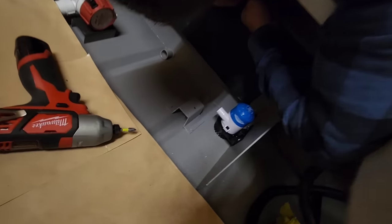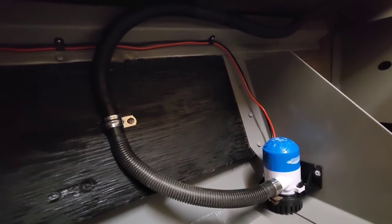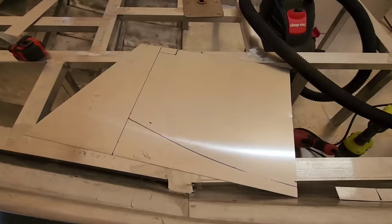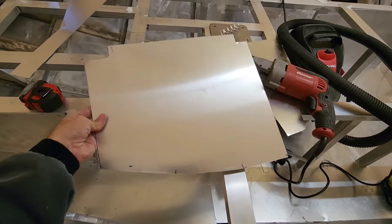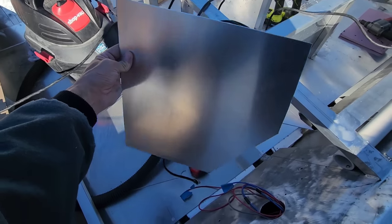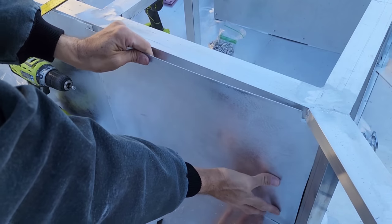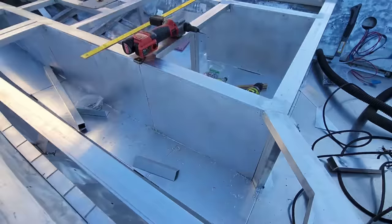Chris got the bilge pump mounted and wired in super clean and tidy, and then we began work on the front deck details. We started cutting sheet aluminum for the vertical walls and the rod locker. There were some awkward shapes that were necessary to template for an exact fit. All the interior hatch walls were done in 060 sheet aluminum to save weight, and countersink rivets were used to attach to the 1x2 1/16 tube framing. Parts that would be painted were pre-sanded before installation.